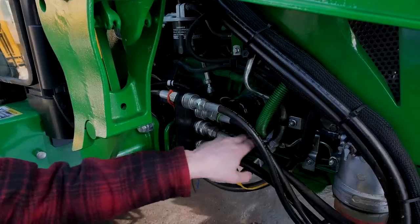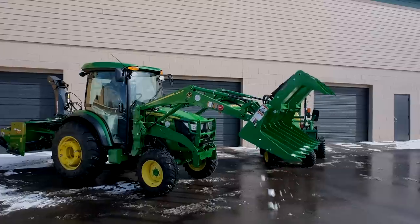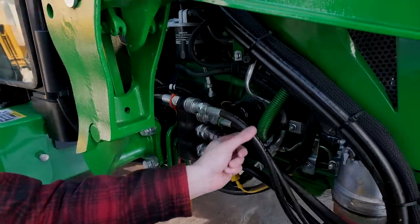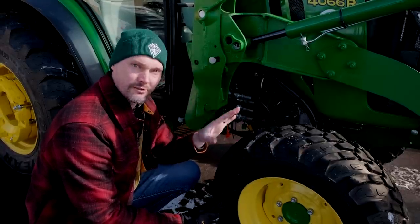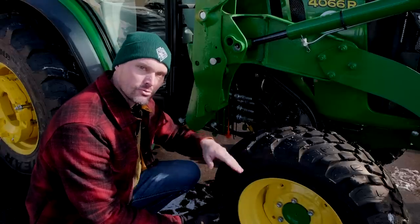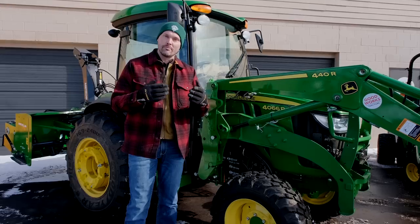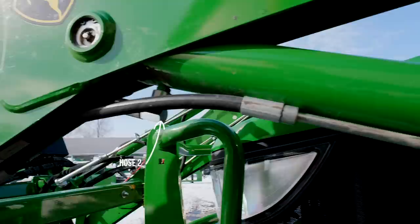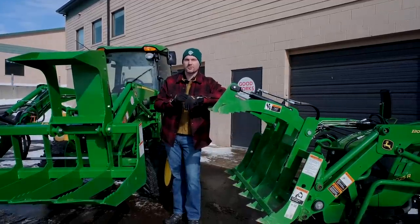This next set of hoses is going to be the second function or the second hydraulic circuit. If the flow goes through the hose this way, it's going to allow you to curl the bucket back. If the flow comes back this direction, it's going to allow you to dump the bucket. What you see on top is going to be that additional function or this additional hydraulic circuit. That allows you to maintain the first two circuits and add on a third function. So if you have a grapple connected to your front end loader, not only can you raise and lower and curl and roll, you can also open and close. That's controlled by hydraulic flow going one direction or another through those hoses. Two hoses make a circle or a loop and allow that circuit to be complete. So now we have a basic understanding of what a third hydraulic circuit is.